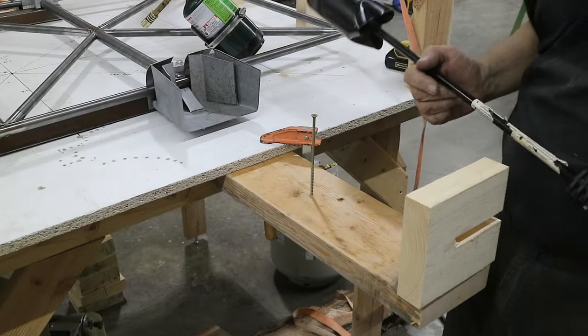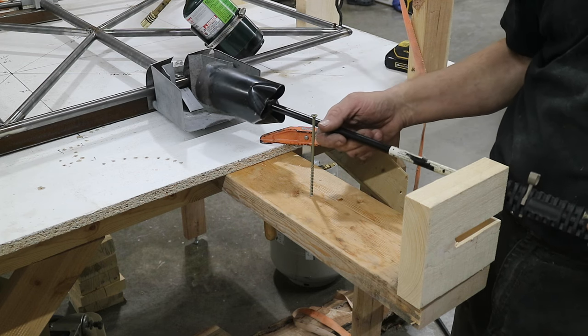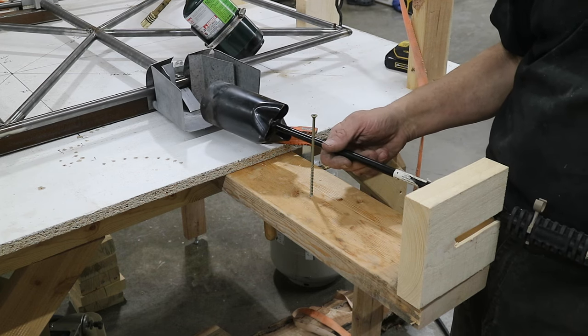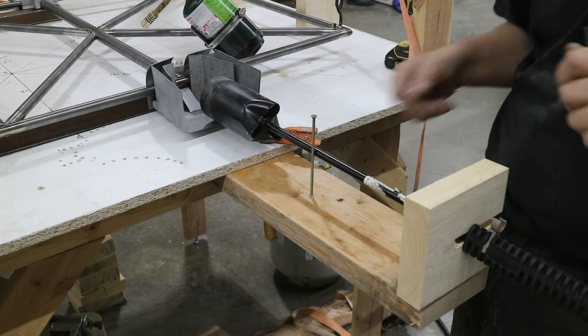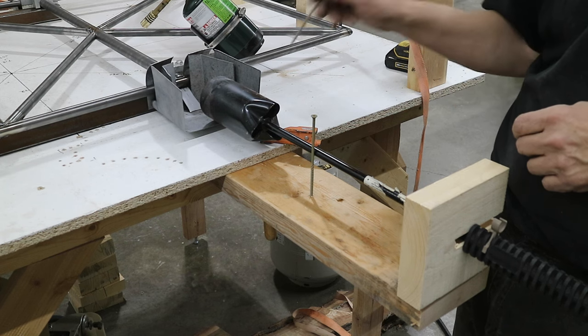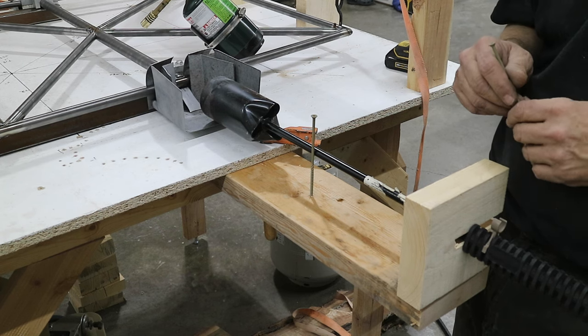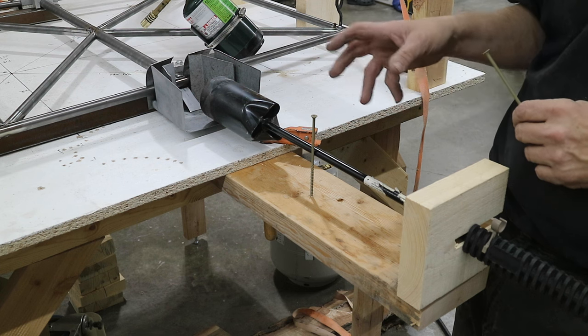All right, this is what I rigged up to get it hot. I'm going to use a weed burner. A propane weed burner is not as hot a temperature as an oxyacetylene flame, but this has more BTUs, so it'll actually put more heat on the target. It gets to a high enough temperature, but it's also not very precise.